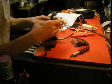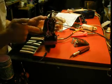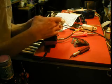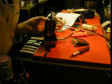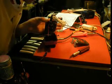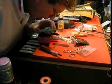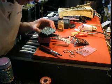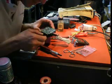Just to further document this phenomenon — notice how I'm shielding the backside of this thing with my hand. No effect or minimal effect from the front. Immediate kill if I go on the backside. Still does it. We replaced the transistor that seemed most suspect, and at first it was fine — I almost would have shipped this thing. I tested it for a while and it wouldn't respond, but now it's doing it again. What in the world is going on here?